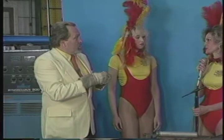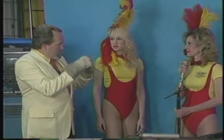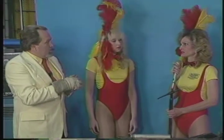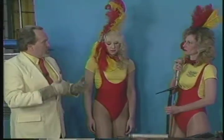Does it still make a puddle though? It'll make a puddle, but it'll be nasty. You can see it all in there. You can see the black particles and things in there. What if it was in an area where you weren't going to see it? Is it weak? Oh, it's weak? Okay. It makes the weld porous and it contaminates the weld.